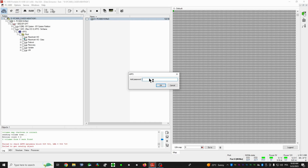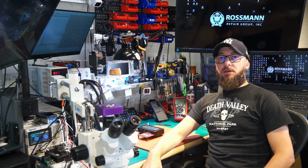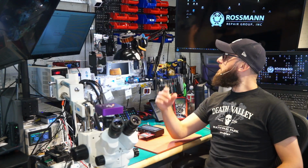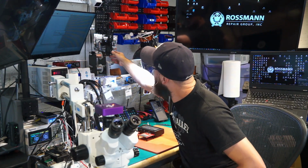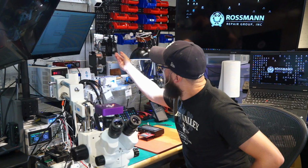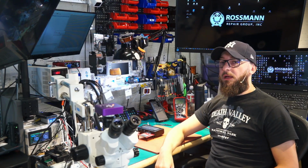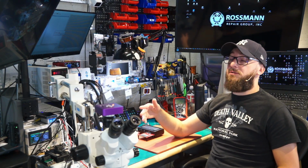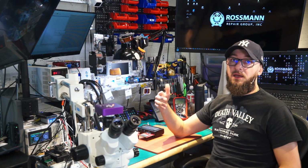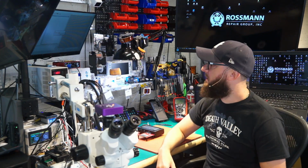So of course, if you take the drive like that and plug it into A1708, then you have to boot from the external drive. On the external drive, I have a few different OSs. This is my test OSs. Different versions like Catalina, Mojave, Big Sur. The drive shows up, and of course it asks about the password. Before I didn't have it. I couldn't even type the password. That's why I didn't even ask the customer about the password.